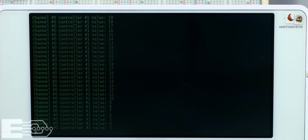And you note that it says channel 0 instead of channel 1. That's because they're labeled in the actual protocol. They're 0 through 15. But when you write them down for humans, you write them 1 through 16. These are listed at the protocol level numbers because most of the people who are interested in this feature are programmer types and whatnot, where you're actually debugging what's coming out of your MIDI controller. This might be a really useful tool for somebody who wants to build their own MIDI controllers and then test them with their Protosynth Midi and really see what it's doing under the hood.